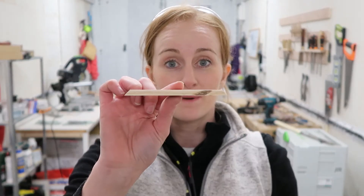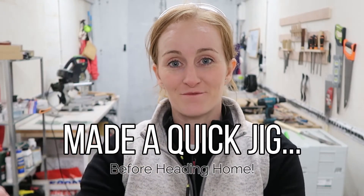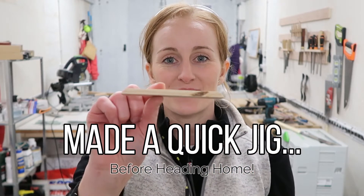We just used the mitre saw to cut two of these pieces. The next thing to do is cut some mitres like this one. I'm not going to be able to do that on the mitre saw because it's going to be too dangerous to hold little pieces. So I'm just going to make up a jig that hooks onto the workbench so I can cut these by hand. I won't show that in this video but I'll show how I made the jig in a future video. For now we'll skip forward to cutting the mitres.